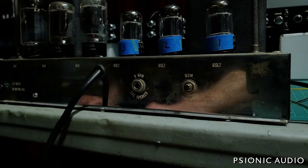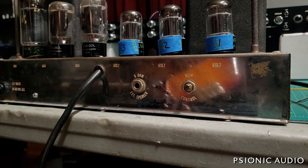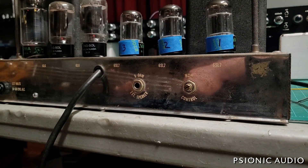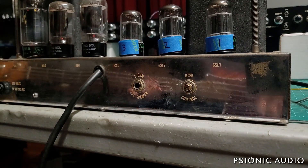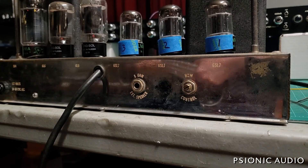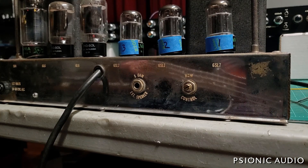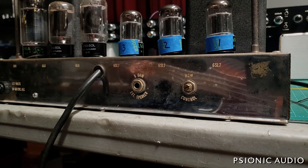I'll fine-tune that for the absolute quietest position. This kind of thing I don't like to have externally available, because it turns into — like a bias knob on those SL amps — a 'hey, what's this do?' moment, and then things go to hell. In this case it just buzzed and hummed, but when you're randomly changing the bias on a 150-watt amp, worse things can happen.